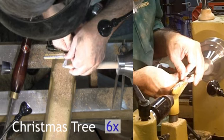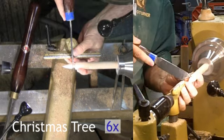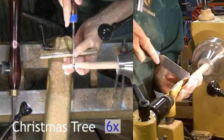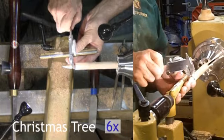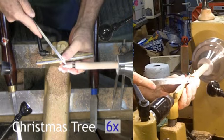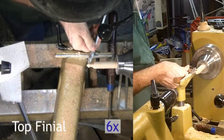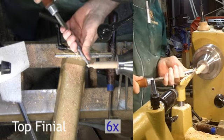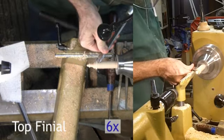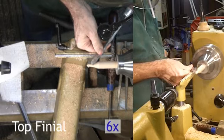Pretty neat. Except be sure to protect any surface nearby that you don't want to become red. It's a bit of a pain to cover all the different surfaces and angles of this ornament from all the different angles. For the tree, I used the end of a maple pen blank. This is mostly skew work — I now enjoy using a skew on smaller diameter pieces. With this itty bitty tree, the problem is the chatter from being so far from the chuck. With the high RPM running on the lathe, I'm hesitant to back up the tree very much with my fingers.